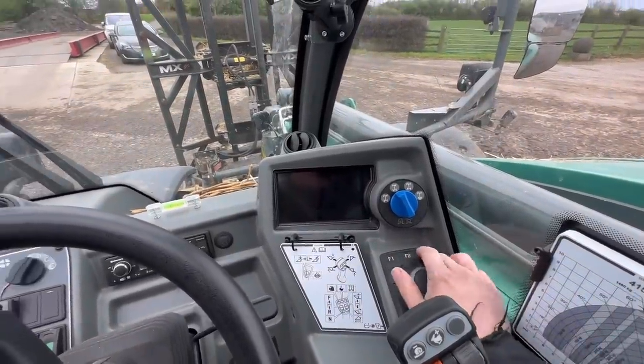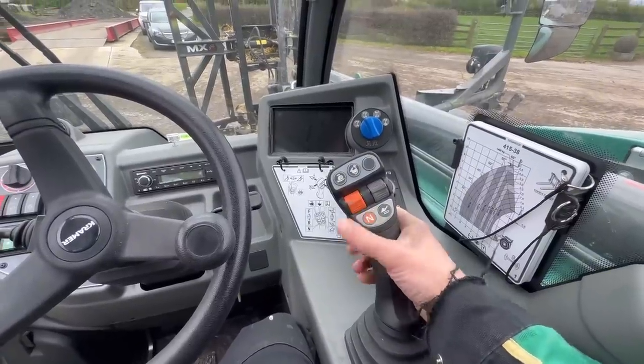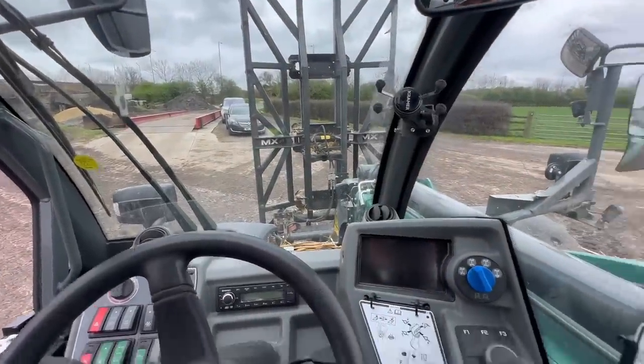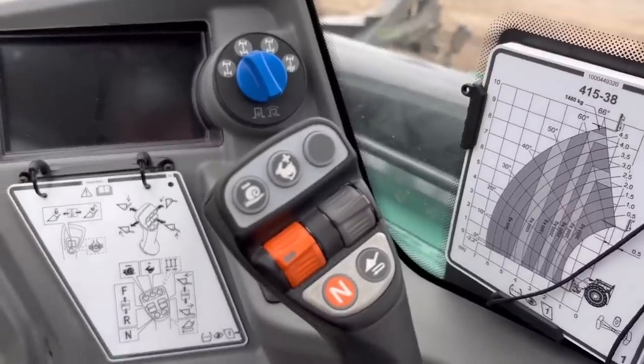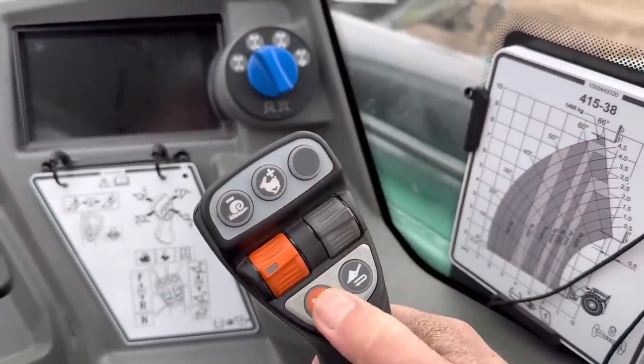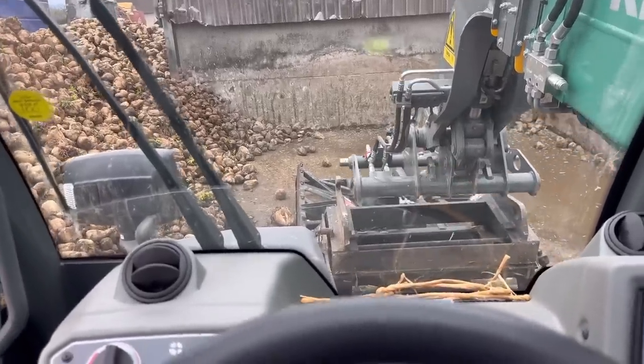Joystick-wise, it takes a bit of getting used to from the JCB. We've got forward and backwards, your third service for grabbing the tines is on the back side of the joystick. Then we've got the gears on top — there are three gears. Neutral returns the bucket to a set position, which is quite handy if you're wanting to go down to a level base. Hold that button and you won't dig in — you can press return to bucket location and you'll know you're not going to be diving down.